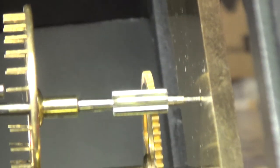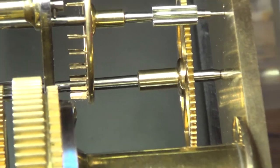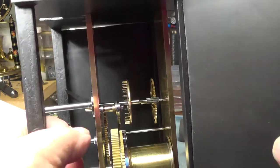A little triangular groove. And on the top plate is also a triangular extension that fits into that groove. So once you've got those cocks removed and the wheels removed and taken out, then the plates can be tipped — the front plate tipped forward at the top, and the back plate tipped backward at the top — and removed from the iron case, and the rest of the wheels taken out.